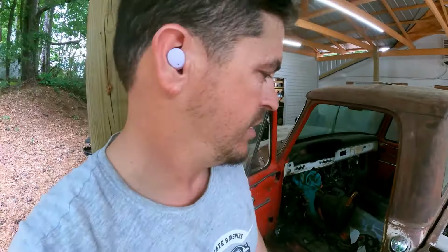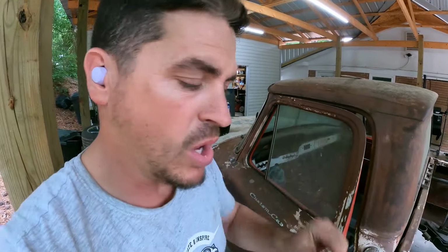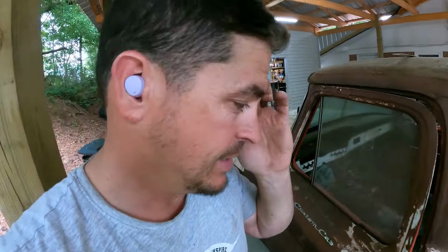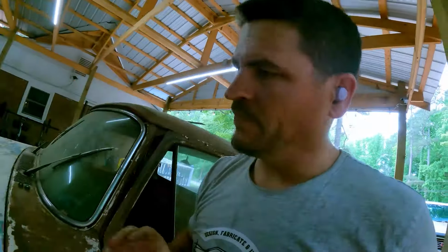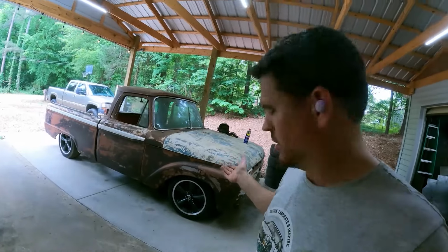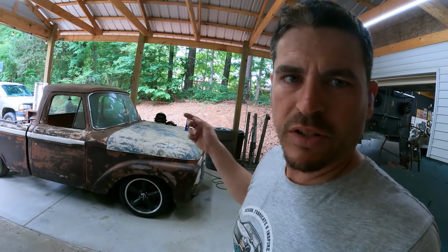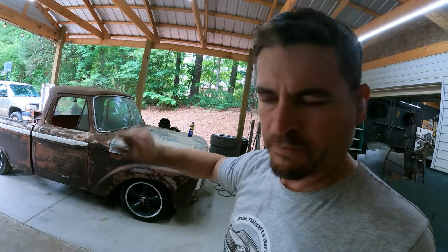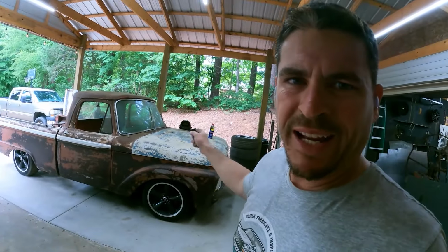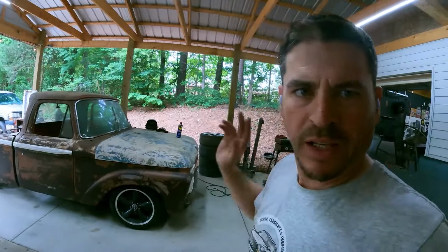So yeah, it's tough. You'll think you have your settings dialed in. Try to run a little bead, even the smallest. You'll get to a spot that's, you know, the slightest bit weak or thin, you'll burn a hole through. So the best way to do it is like I did it on the bottom side, just tack. So what does that mean now? That means now I'm gonna have to make this thing look less like a truck temporarily. So I gotta rip the front clip, the hood off to where I can finish the firewall. Because before I was hopping in and out of the engine bay, it'd just be easier to rip this front off and then go to town.